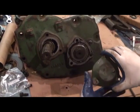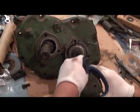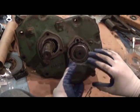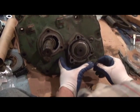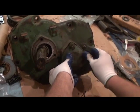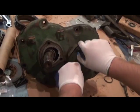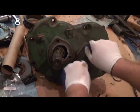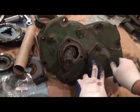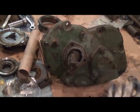Then we're going to see if we get lucky with the bearing cap. Get all that lined up just right. That's why we bring these videos to you from Steiner. We like to eliminate a few headaches for you. You know, just like that little trick, you'd look at it 4 times and think, oh geez, am I cross-eyed? Did they not make the gasket right? And then you figure out that the holes are not equidistant. So we'll tighten those cap screws, and then we'll move on to the next step.